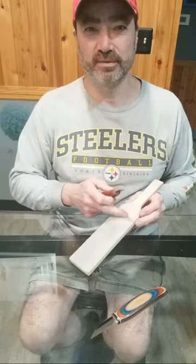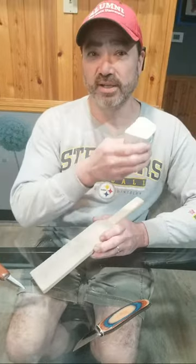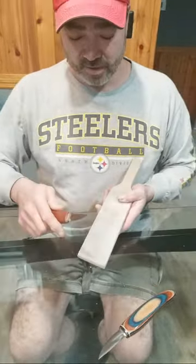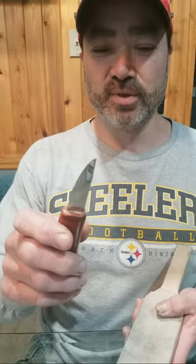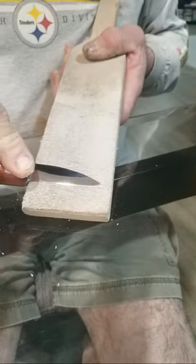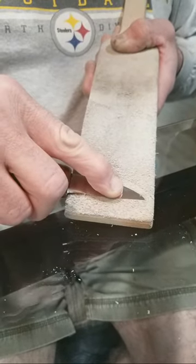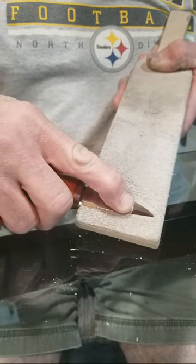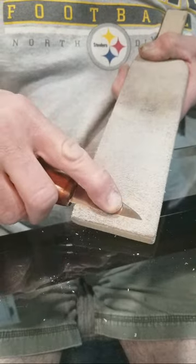After I'm done stropping, come in here and strop this. Also, these are now available on our website if you'd like a piece of compound. All right, straight blade — we went through our curved blades here recently, so we're going to go to a straight blade. This is a longer blade, 2¼. So I'm going to put my finger on there just so I can get equal pressure here and here. Here's with my palm pushing down on the handle. I'm going to — cutting edge facing away — pull it towards me.